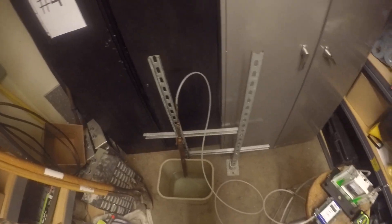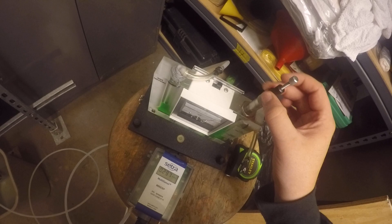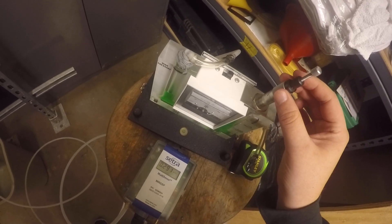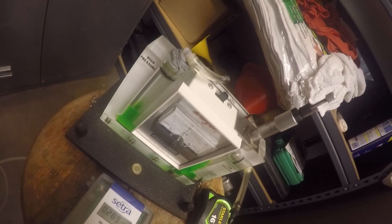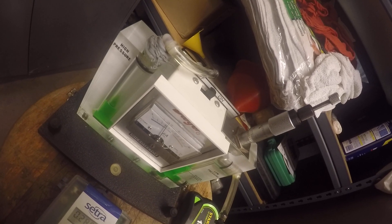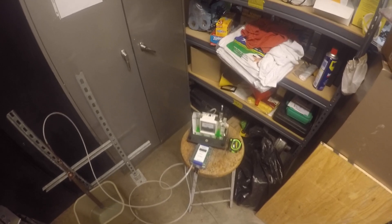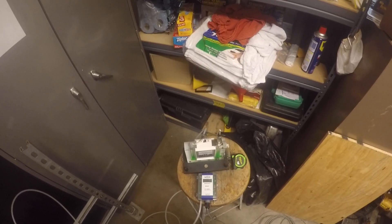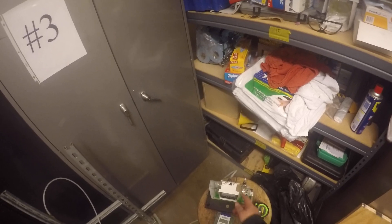We're going to go ahead and have our calibrator try to find the set point. So there's our point — that's about 1. And then we have a quarter, I believe. And then about 17. So that would be about 1.42, just about there. Double that and that's about 2.84. You need to double the measurement on this because there are two columns of water to measure instead of just the one.